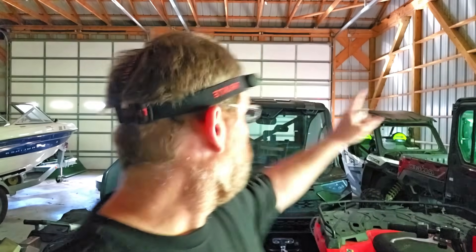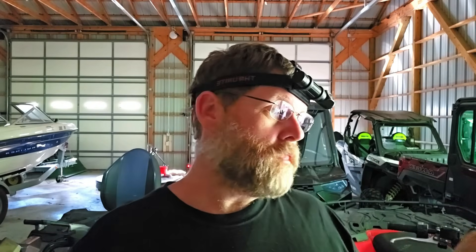So this is what I found. When I first came here, right over here on this wall, there was a GFCI doing the same thing. I found that the neutral and the ground were touching over here — that's the one thing I found, which kept tripping the GFCI. If you know about a metal box, neutral touching the box causes an imbalance. That was a problem I had before in this box. Fixed it, no problem.